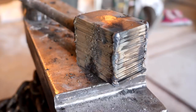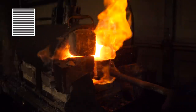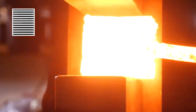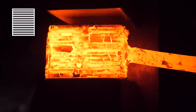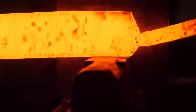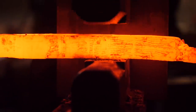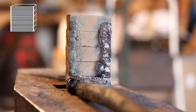Here's our alternating 15N20 and 1095. Let's forge up the main piece that our other two billets are going to come from. Just because we drew up a nice picture with good parallel and perpendicular lines, it doesn't mean our final billet will appear that way at all - those layers are going to be mushed, warped, and skewed, but the overall look I hope will be somewhat intact. Let's cut it up, stack it, get the pieces welded together, and increase our layer count to 150.